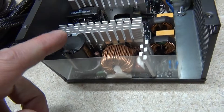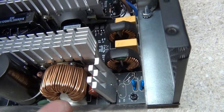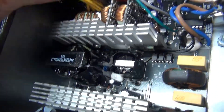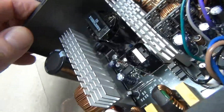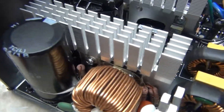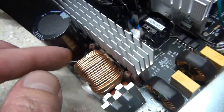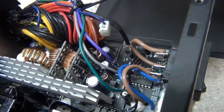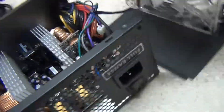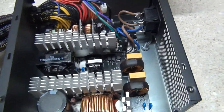If you look in the box here, you're gonna see your capacitor and your toroid transformers. These are toroids, and then you have capacitors down in the bottom. If you look on the sides, you can see the transistors hooked up to that huge heat sink. You have a few resistors, ceramic capacitors, and the AC connection right there. This is what it looks like inside a DC full bridge rectifier.